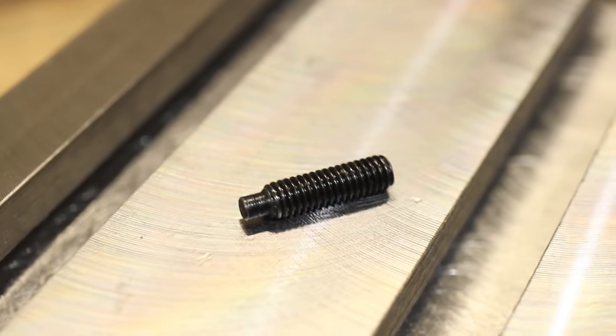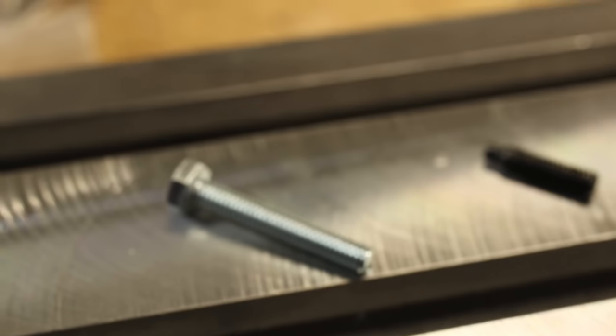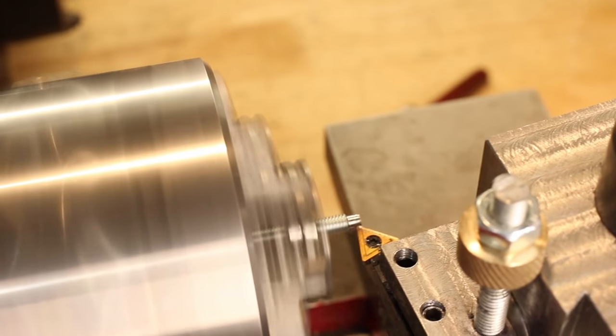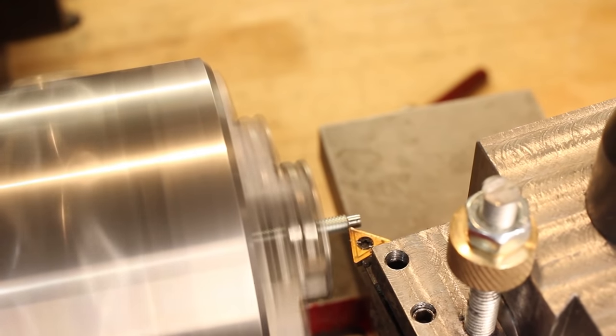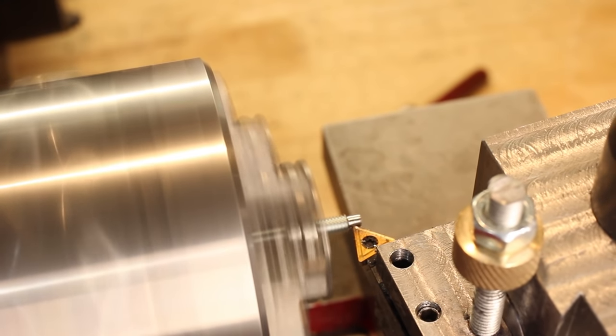We can now make the gib adjustment bolts. They're typically machined down at one end, so I'll quickly do that in the lathe. I'll be using hex bolts as a short-term solution until I can get my hands on some extra long M4 grub screws.